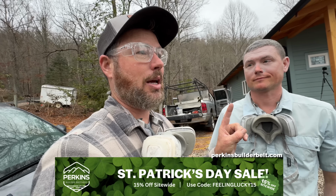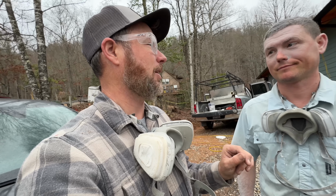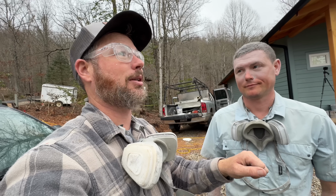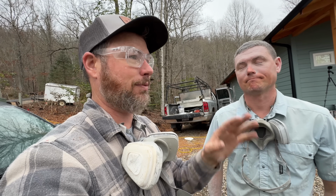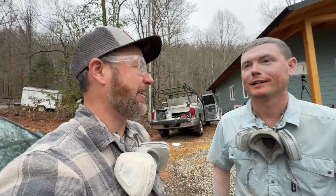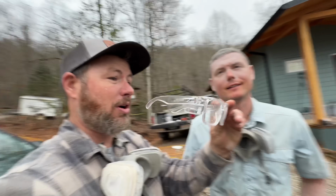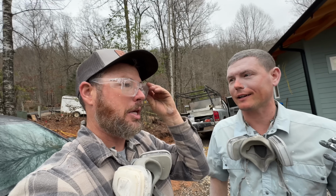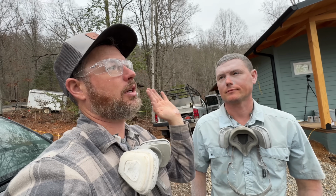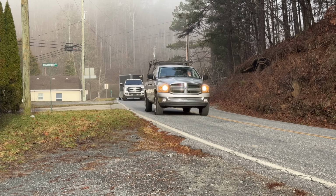And we did something extra special this time. We tinted the primer because on the ceilings, it's always hard to tell when you're going over white primer with flat white ceiling paint, which the primer is kind of flat too. It's like impossible to tell. White over white. It's maddening. So I think the tinted gray primer is going to help us get a more even coverage on the ceilings.